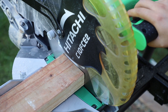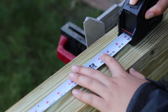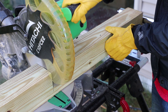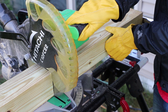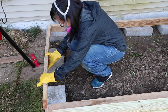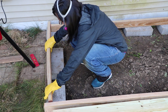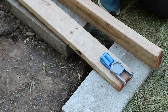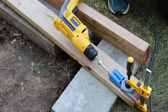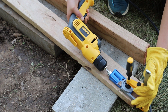For the lumber in this project, except one 4x4, all other pieces are 2x4. I use pressure treated lumber for the foundation — in total there are three 8-foot 2x4s and one 8-foot 4x4 — since they're at ground level and more likely to contact water. You might notice some of the lumber is a little warped — that's okay because I found them in the cull lumber cart at Home Depot. Home Depot picks through lumber and puts pieces that are warped or cracked into the cull cart at a 70% discount. If you don't need them for fine furniture or a full 8-foot length, go for it — you can cut off the bad part and use most of it.